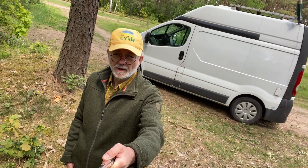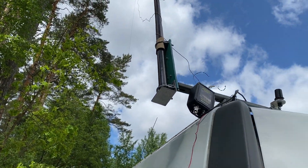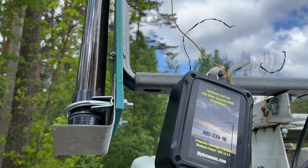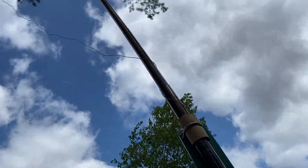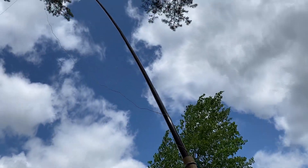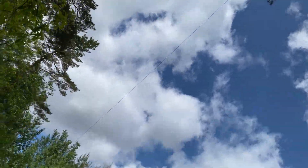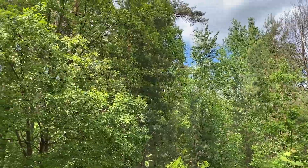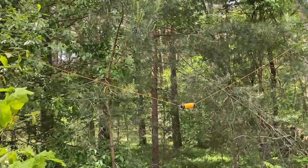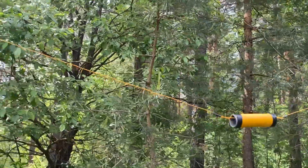Stay tuned and you will see how successful I will be. My antenna today is an end-fed half-wave 80-to-10 meters shortened antenna, 49-to-1 balun by myantennas.com. This antenna holder holds my six-meter tactical mast. Today this antenna is deployed in the shape of an inverted L — six meters up to the top of the pole, and then the other maybe 16 meters slopes down into a tiny pine tree over there. You can see the loading coil, which is the most important part of this antenna.